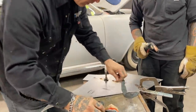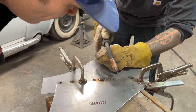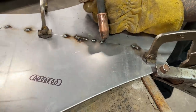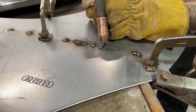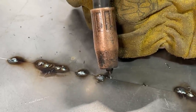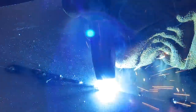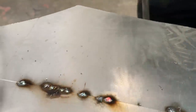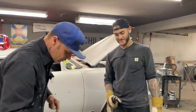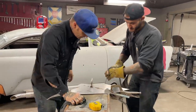Let's do another one. So what has to happen? Let's just do it on your own. And once you get that a quarter inch away from there, where you want that right on where you're welding, you hold it there. Right there, right? Yep, you're holding it there. Keep holding it there. Do not move. Close your eyes. You got 2 seconds. Pull it. Good. Awesome. Now you've welded that together. Cool. Okay, let's do another one. Let's do one right there. Get it where you need it.